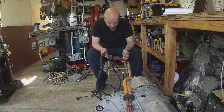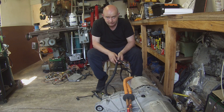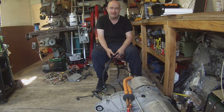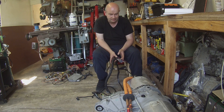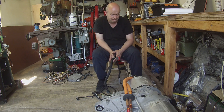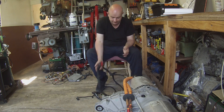That's part one. Part two — we're going to put some 12 volt power to this thing and see if we can wake it up and see if it actually transmits any CAN messages. I'm pretty sure that even on its own it will transmit some CAN messages when we get power to it, so at least that would tell me that the logic board in here is working and is powered up.